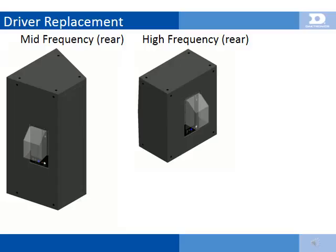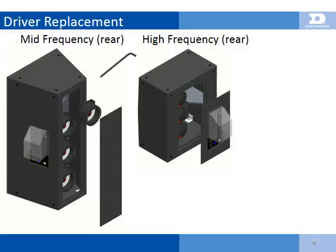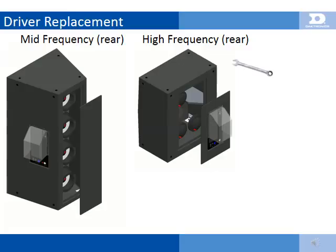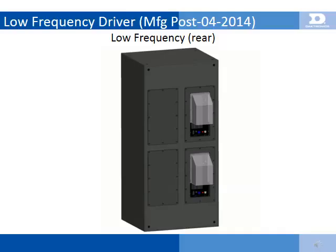Service of high- and mid-frequency speaker drivers is provided through the rear access doors of the 1500HD cabinet. The drivers are easily accessed through removable rear access panels on each speaker. These panels are weather-sealed with silicone and must be cut with a razor along the perimeter. They are fastened with 5/32-inch hex machine screws and can be removed with an Allen wrench or a hex bit mounted on a drill driver. Replacement of the mid-frequency driver requires a 3/16-inch hex bit or Allen wrench for the four machine bolts per driver. High-frequency drivers are mounted with four threaded studs facing forward, fastened with 10mm nuts. A ratcheting wrench will help make the job much easier. After replacing the driver, the panel must be replaced and the joint must be resealed with silicone.